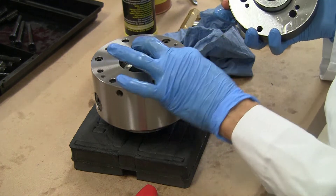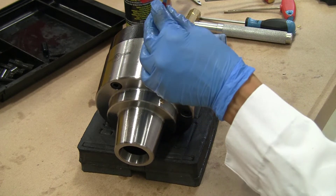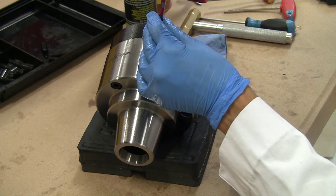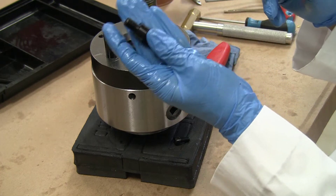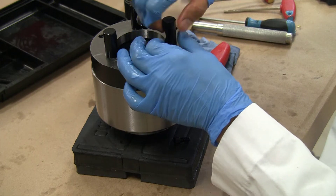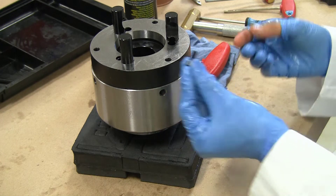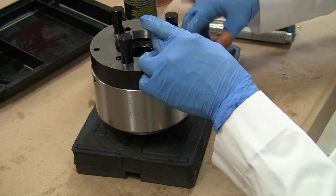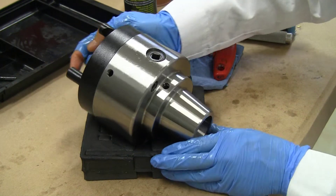The retaining screws have been put in and the back plate has been installed. Putting in the set-true type set screws as well. Next we'll work on the cams — they have a line on them that serves as a depth marker. As you screw them in, you should screw them in to the line, and hopefully that will align them all to the same depth. This screw keeps the cam from rotating back out. Everything is now very nicely assembled.